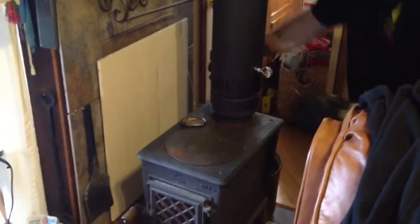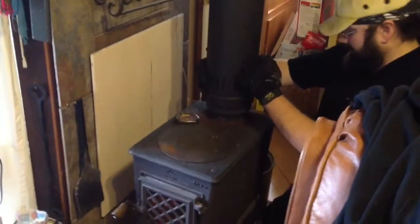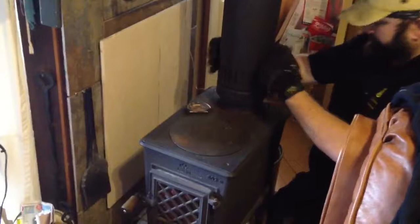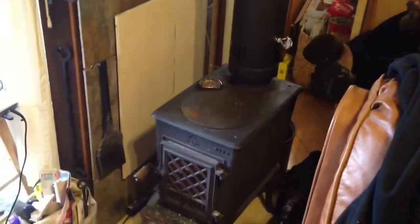High-speed steel will just push the inner steel in, like we're trying to drive it in rather than cut through it. The cobalt bits are so much easier — they go through a lot quicker. There we go, now you're all the way down on that.